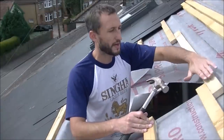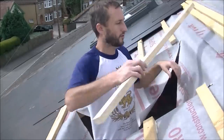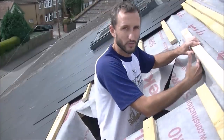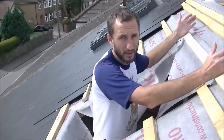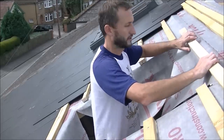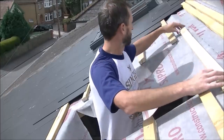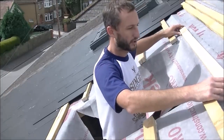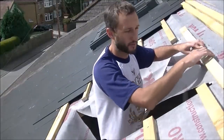With the instructions, they say you need to place a batten right at the top of the window opening or your frame. I've already done my frame - you can see the 2x4 right there. I've got to place this length of batten directly in line with the inside of the 2x4. This length of batten needs to be the width of your opening plus 200mm - so 10cm overhang on each side. Line that up centrally once you've cut your batten down to size, then nail it into place, leaving the felt hanging up on the bottom of this batten.